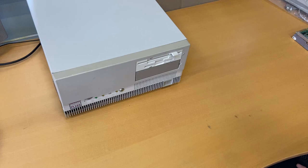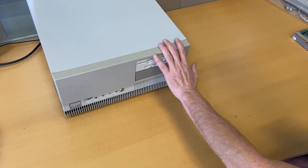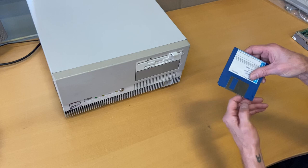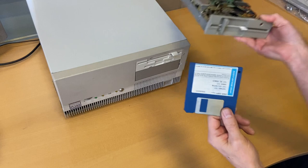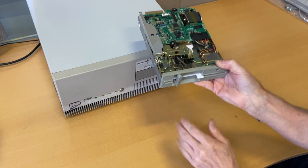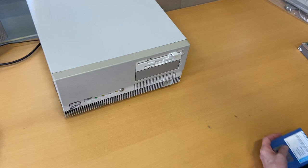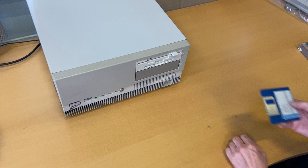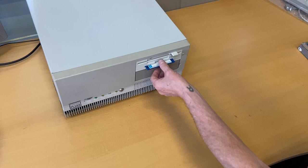The computer is on the table and something has happened — we were struggling with the BIOS setup and it was coming up with a lot of errors. The problem was I didn't have the BIOS setup disk, but I have it here now. The challenge was that the five-and-a-quarter drive wasn't compatible with the three-and-a-half, so I put in this combined drive temporarily while we fix the BIOS.